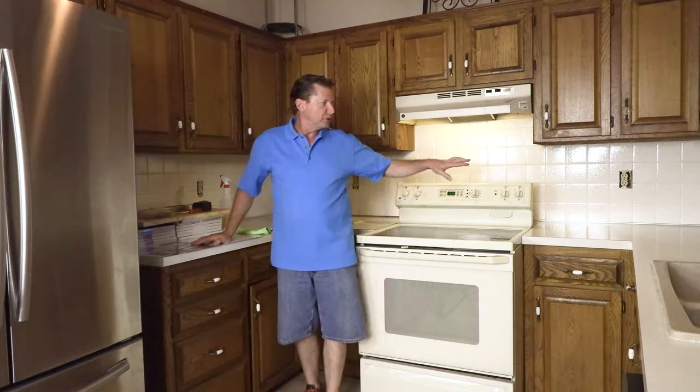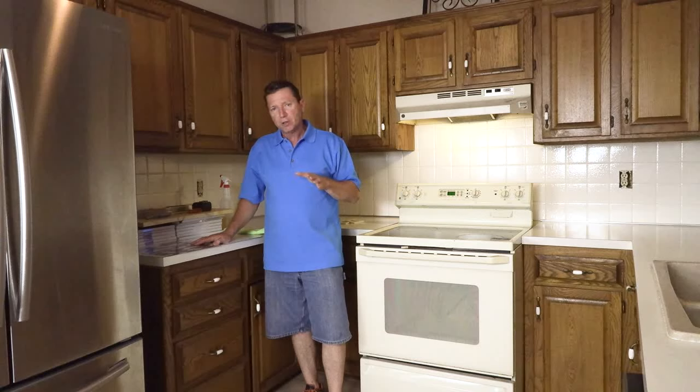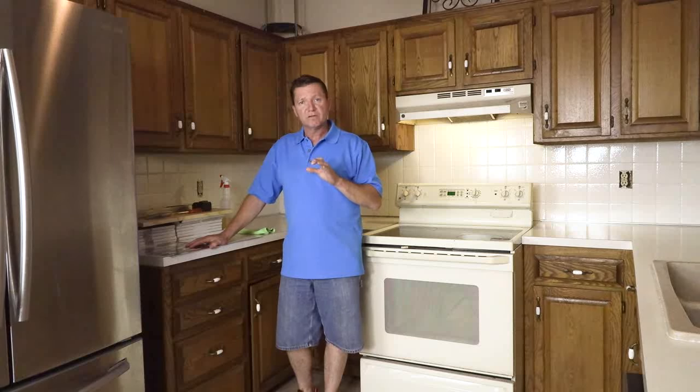Also, if you're using a painted wall — you can see we've got 4x4 tile we're going over today, and we've cleaned them ahead of time and got the plate covers off. If you have a painted wall, make sure it's clean, and possibly sand it real lightly so the tiles will stick better. They recommend that if it doesn't stick very well, get a can of spray adhesive and put a little bit on there, and everything should work out fine.